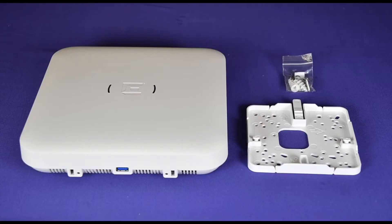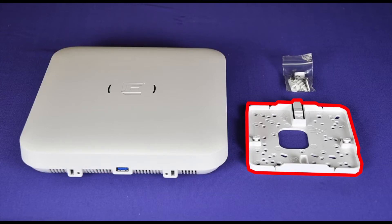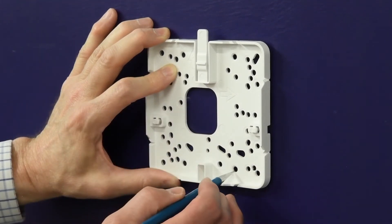The following hardware is required: one AP500 series access point, one 30516 wall04 bracket, two screw anchors, and two Phillips pan head screws. With the bracket tab pointing up, use the WSMBI wall04 as a template and mark the holes to be used to mount the AP.